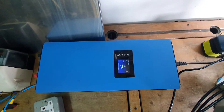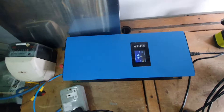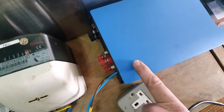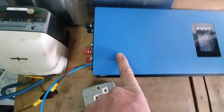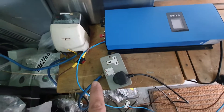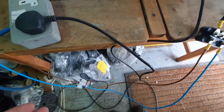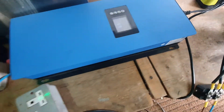This is a two kilowatt wind turbine grid tie inverter, 45 to 90 volts, three wire AC in. Inside is a bridge rectifier. I opened it up and took two tails off the DC side of the bridge rectifier, so I could connect a DC solar panel and a wind turbine generator, feeding both in at the same time.